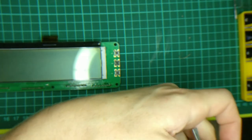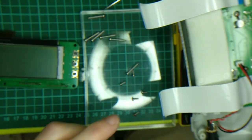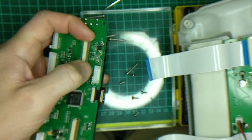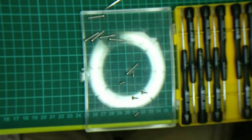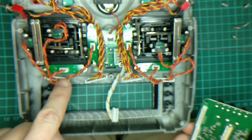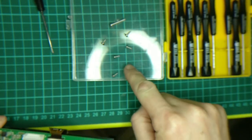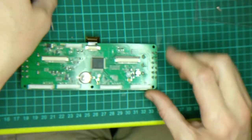To get this out, those are the screws you remove — six from the back case. Remove these from those; these pull forwards. Pull these little brown bits at the same time, and slide the connectors out. These five wires come out. Then take the five screws out — these short ones — to take the circuit board out. And then you've got to remove the buttons.